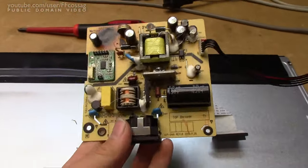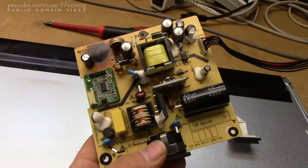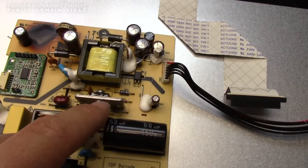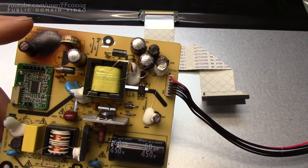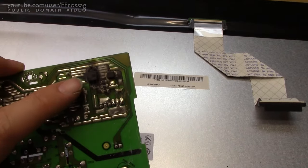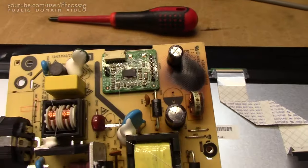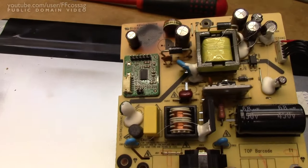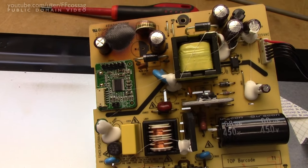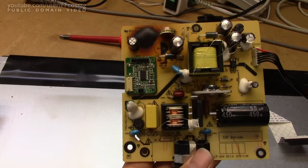My goal is to convert it to just DC operation because I need it for a DC application. It seems to have a bit of an odd power supply arrangement — we have normal stuff: a primary capacitor, a single switching element, a dual output group regulated off the right side where we've got the optocoupler. I'm not certain if this is just a rectified diode or some kind of extra switching element, because the LED driver is just an extra little board they've tacked on. This is a relatively early LED monitor, so they seem to have just purchased an off-the-shelf module and tacked it onto what looks like half of a normal CFL driver board — like they just chopped off the CFL driver.